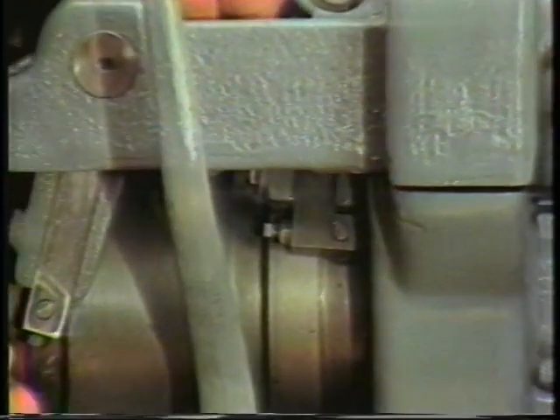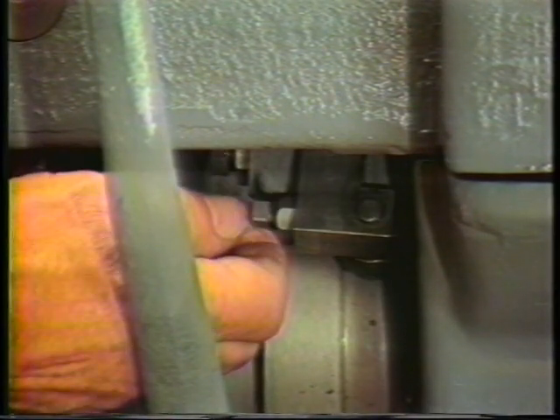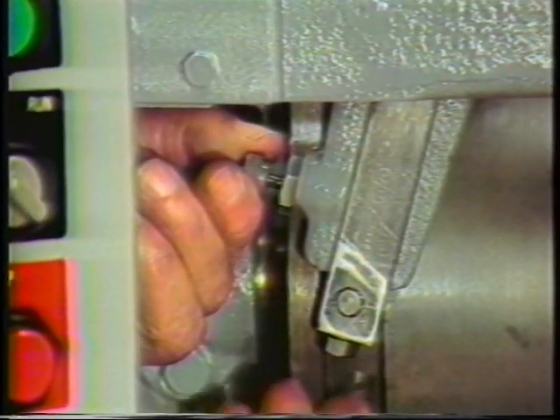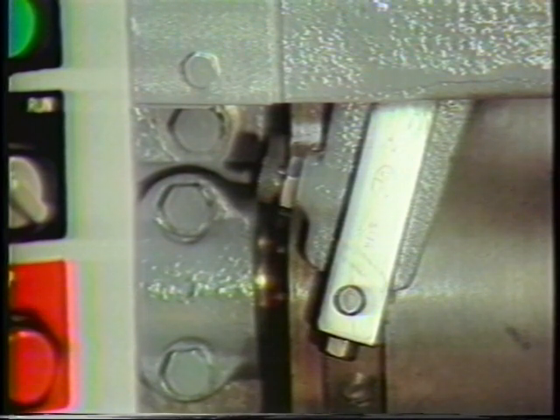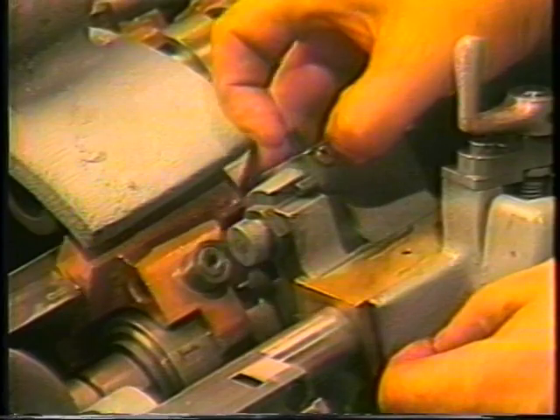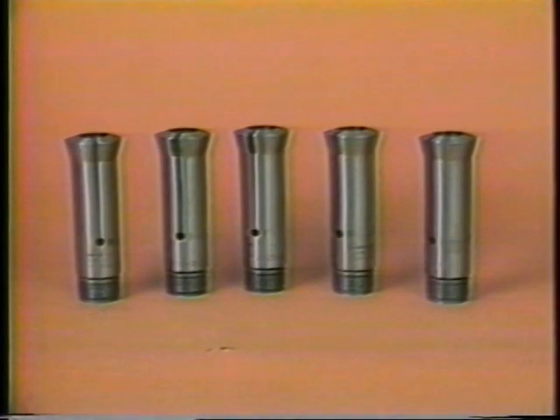Disengage the chuck lever roll throw out and the feed lever throw out, and manually open the collet in the 5th position. This will ensure the bar end will retract with the feed tube. Pull the feed slide detent knob and lift the feed slide latch. Slide the feed tube assembly to your left off of the left slide bracket and out of the machine. Repeat this procedure for all 5 work spindles.